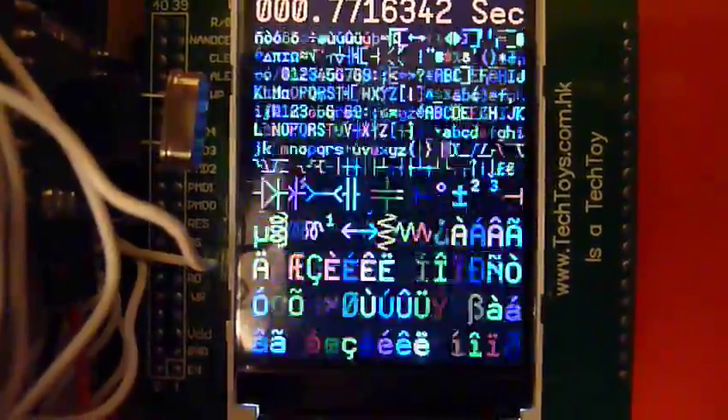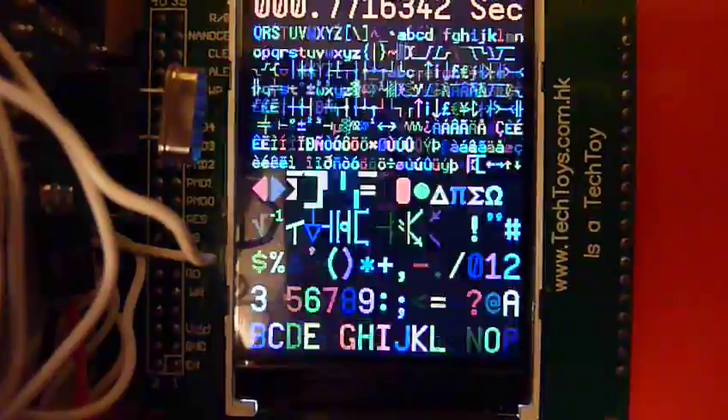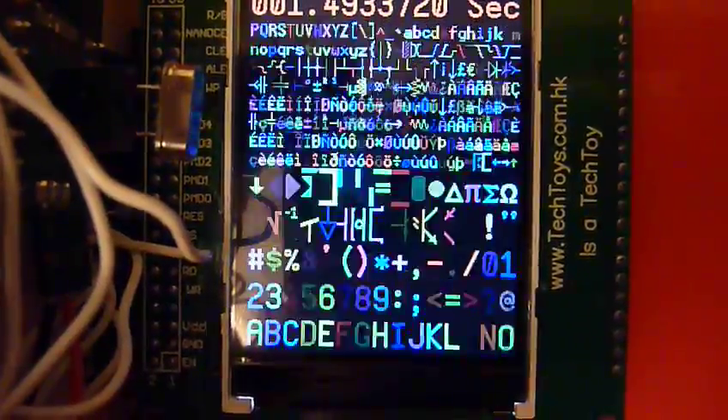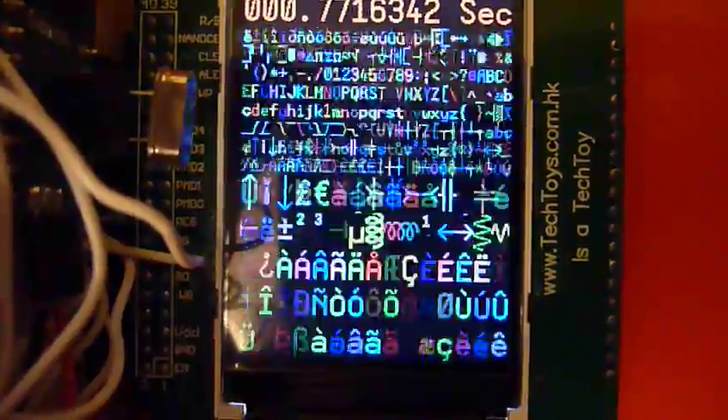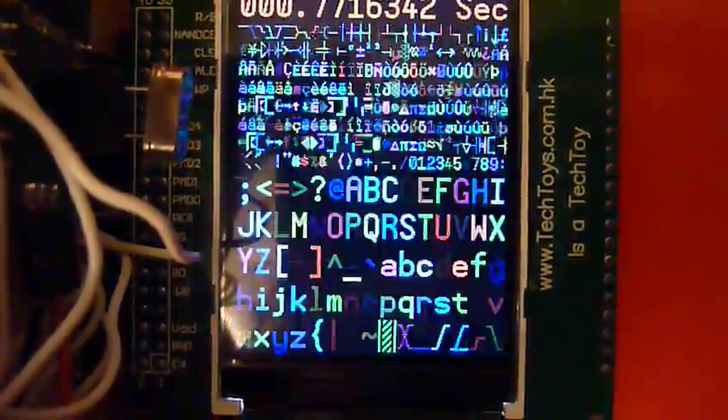The fast writes are using the waitvid hardware to speed up the byte writing to the LCD controller. It's an ILI 9320.